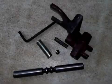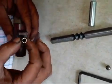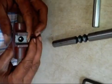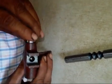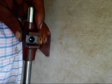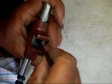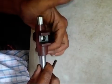Fork and fork shaft fitting. Fork tool is required for fitting of fork. First, set the fork tool to one side of the fork and push the fork shaft to the other side of the fork. Then, fix a spring and a steel ball to the spring holder. Then, press the ball inside by a 5 mm Allen key and immediately joint fork tool and fork shaft at the time of sudden ejection of the Allen key.